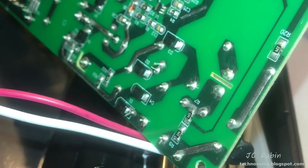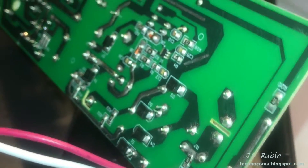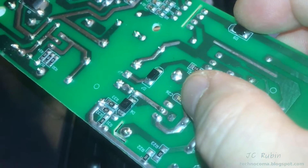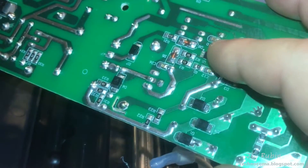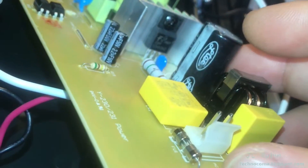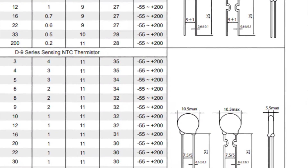Looking this part up on Mouser, I see I could purchase one individually for about a dollar fifty — add it to one of my other orders to avoid shipping cost. So about $1.50 would get this unit working again. It's worth noting that if this were out of warranty I would definitely be removing this component and doing a more exhaustive test — the capacitive test — to definitively confirm it as the point of failure. I'd also be going around these other components to check if they're in spec, working back from this unit to identify the root cause.